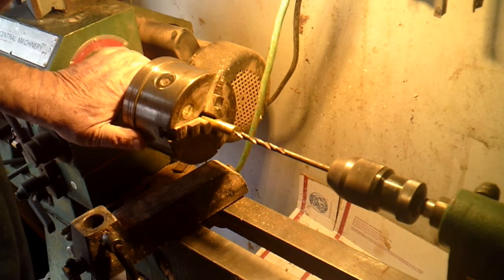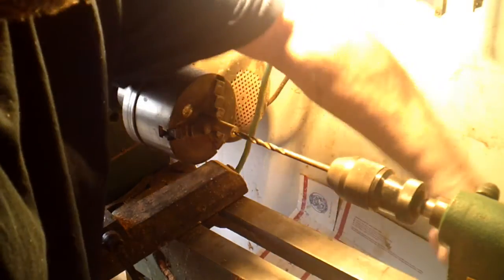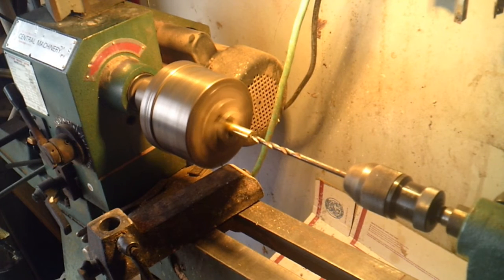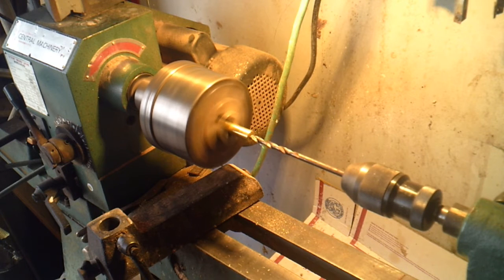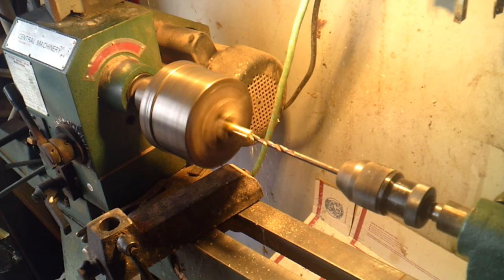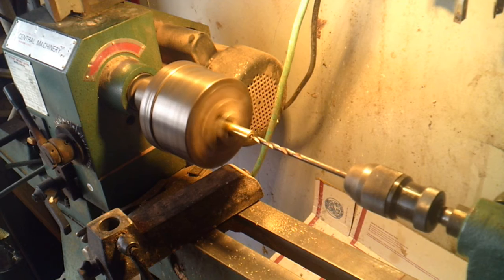You bring the bit in — you don't have to be touching, but it doesn't hurt anything. Once the center is marked, if you see how the length of that bit you'll probably be wondering. So, once it starts on that diameter it settles down. You drill the hole that will be exactly the same size as the outside of the brass tube — the tube you glue into the inside of your blanks. So that's good enough for now. We have it drilled.